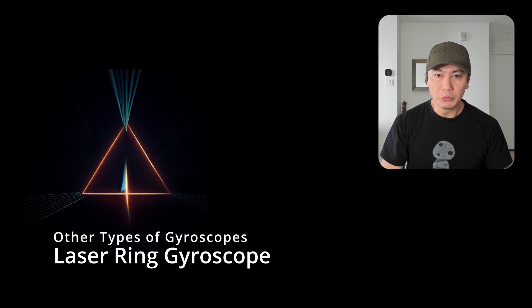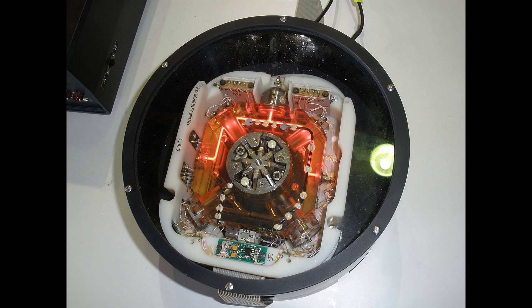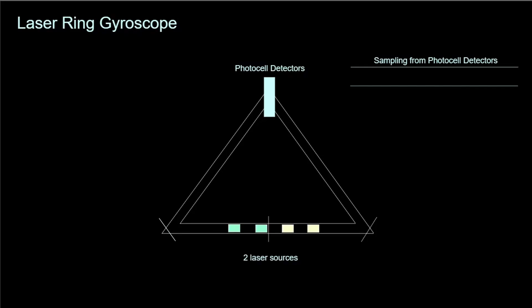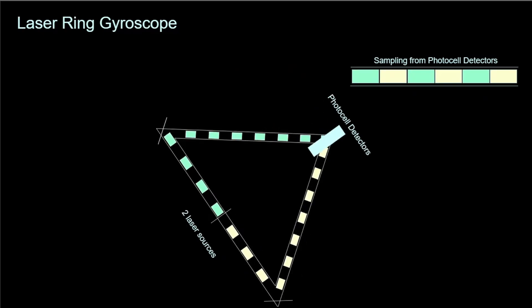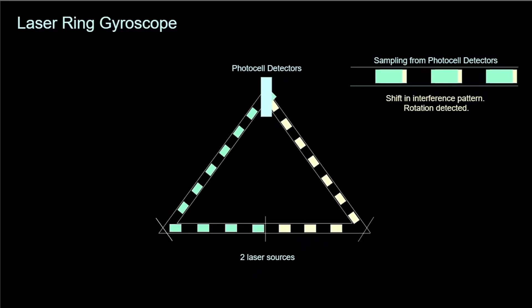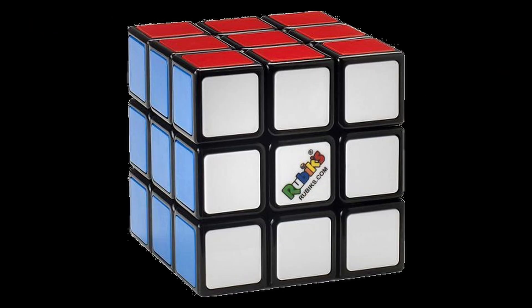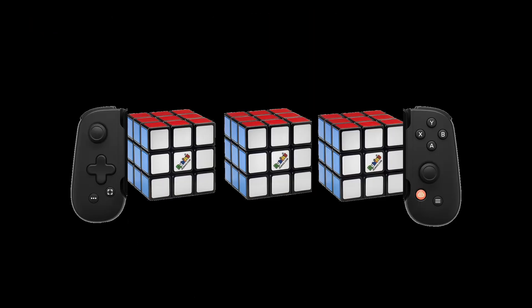There are many variations to the original gyroscope. One of the most commonly used nowadays is the ring laser gyroscope. It uses laser beams to measure the rate of rotation. It doesn't have any moving parts, making it much more durable and much smaller than the spinning disk. But it is still not small enough to fit inside our game controllers — the smallest is about the size of a Rubik's cube, and you would need three of them.